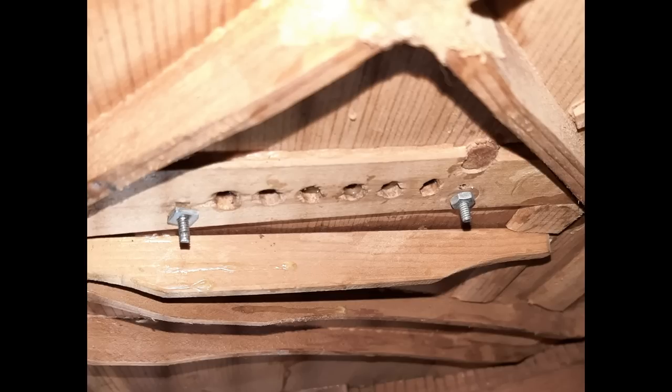Let's have a look inside — some revealing things are revealed. It seems that someone decided the braces could use scalloping after the fact. Now this was an operation you could get your neighborhood master luthier to do back in the day, usually in 1970s Martins. This is pretty early for this kind of job. These braces originally were straight tapers and sort of triangular in section, only slightly heavier than the pre-war models. The amount taken off here is not completely unreasonable, but it's not difficult to seriously undermine structural integrity by going too far. Maybe it did happen, because this also has an extra brace directly behind the bridge pad — the slightly lighter colored one. This is sometimes a way to tame a bulge in back of the bridge. It flattens it out slightly. I think of it as Don Musser's little brace, because he started bracing guitars like this in the 1970s and found it produced a more even response and cut down on soundboard deforming.